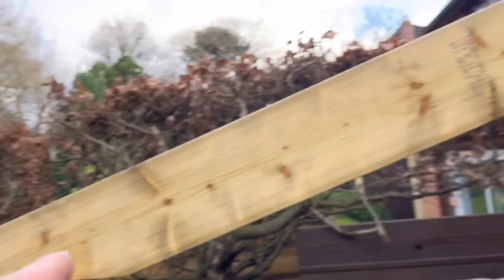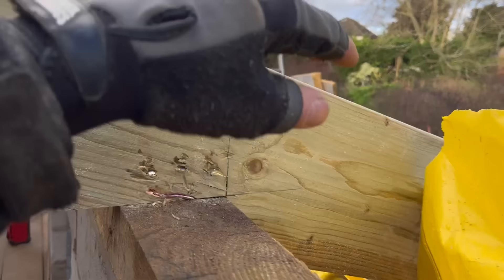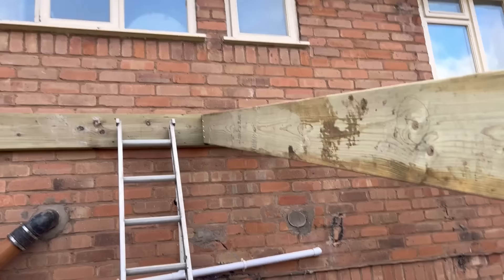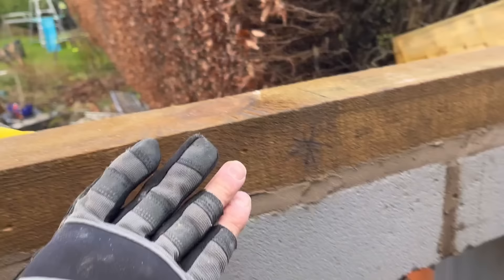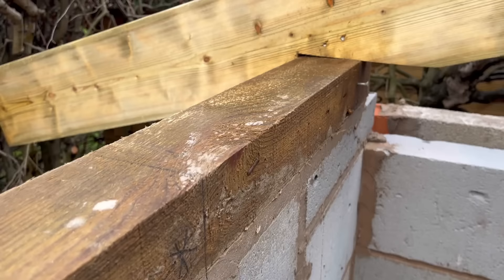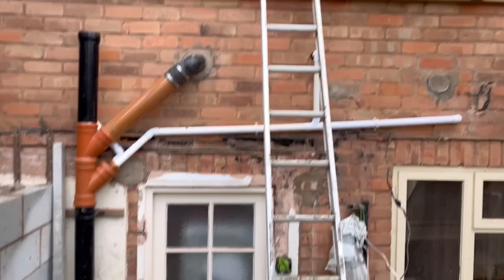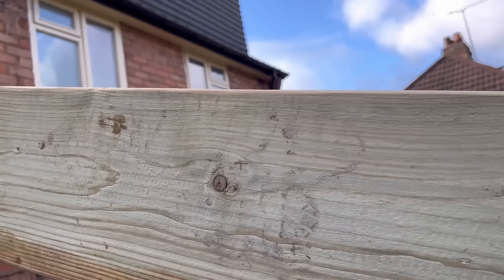Three remaining rafters. This last section is 8mm bigger, so I'll take my pattern, add 8mm, then knock a pencil thickness off for each of the last three — because I know that increment worked. The plumb cut and seat cut on the bird's mouths are good; any gaps are just from slightly rolled timber, not the carpentry. You can see across the roof they're all flat. A couple have quite high crowns but they'll settle, especially with warmer, wetter weather. I've made sure the flat ones are on the doubles so they don't need to settle.